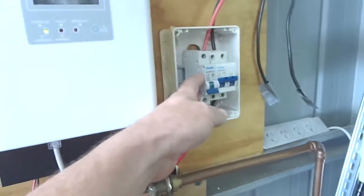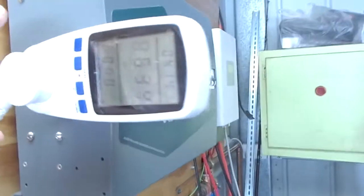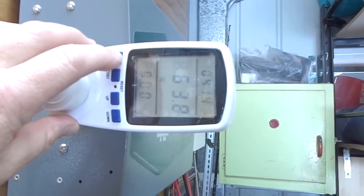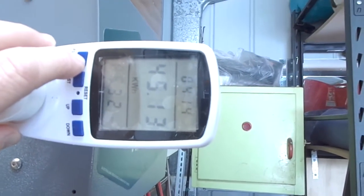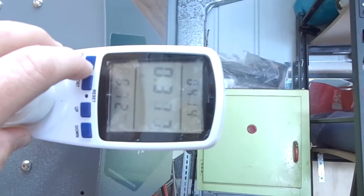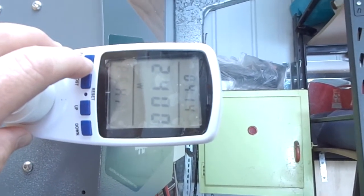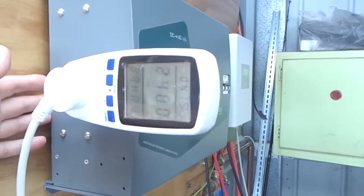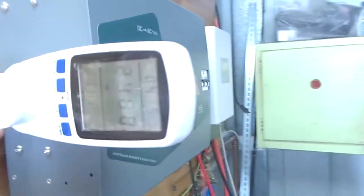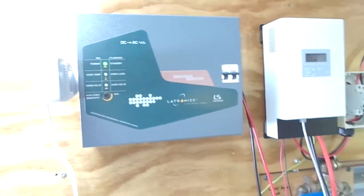I've just made a small change — I've added a circuit breaker in a little enclosure which has the AC circuit breaker, but I'm not using that yet. I haven't hardwired the inverter; I'm still just plugging in. Right now it's drawing 63 watts. I've drawn 45 kilowatt hours in the last two to two and a half weeks. It's showing 236 volts, 0.3 amps. The high wattage was 2400 watts — this is an 1800 watt inverter rated for 2200 watts for half an hour, but it draws 2400 watts no problem, which is really impressive.